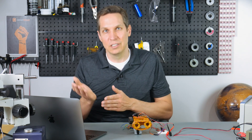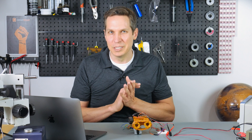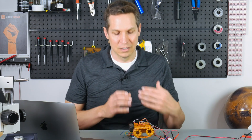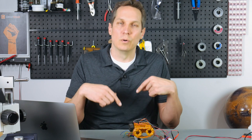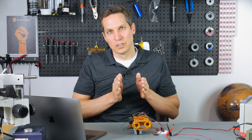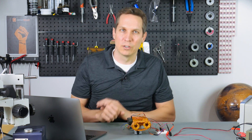These things are pretty simple, and doing that simple multiplication and division is quite straightforward. Even though with assembly, as we're using here, it's a little bit more complicated — if we were using C it'd be incredibly simple. The general idea is we're going to take some code that sends out a trigger to the ultrasonic sensor on a regular basis, measure that amount of time, and as long as the distance isn't less than four centimeters, we'll just run our subroutine to move forward. If it does detect something within four centimeters, it'll jump into our reverse subroutine, do that, and then start the detection process all over again. That's the basic architecture of what we are going to be doing in assembly today.